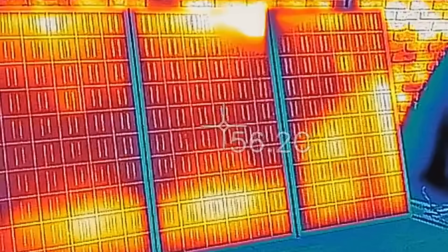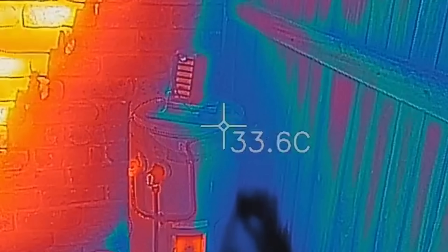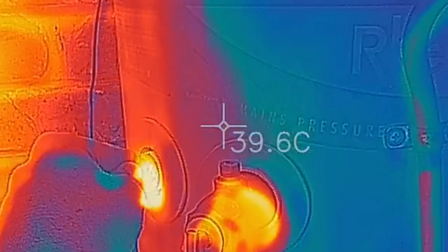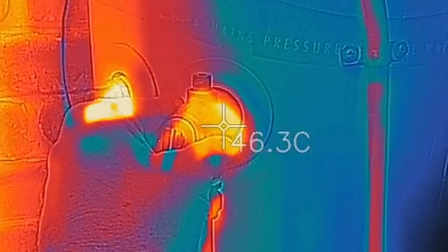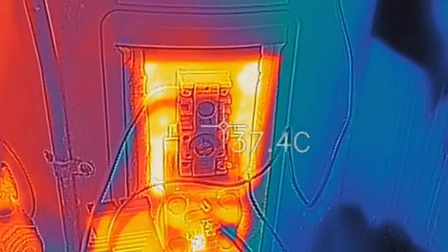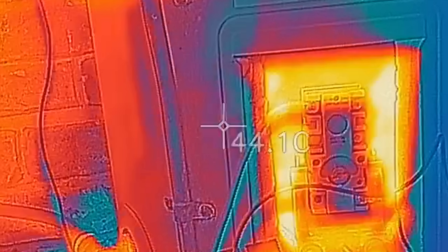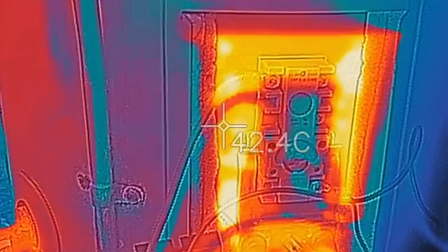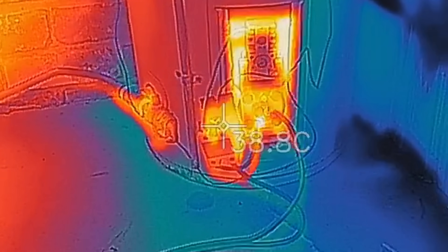Tubers, we are four hours in. We've still got perfect sun on those panels, which is fantastic. I even gave them a bath to clean all the bird shit off of them. And we are going fantastic — we actually have hot water. There's the exit pipe, it's nice and hot. I can still touch it so it's not burning up. About 45 degrees, so we are getting there. All the pipes are nice and hot, and if you have a look in there we've got some real heat — about 50, 51 degrees. I have the thermostat set to 60 degrees, so it's likely to actually turn off soon, which will be an interesting test. That will prove it works with only three panels.